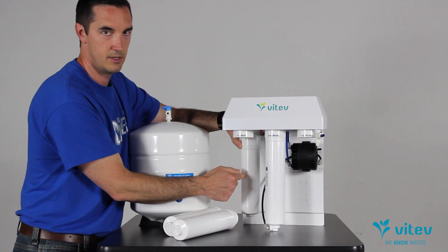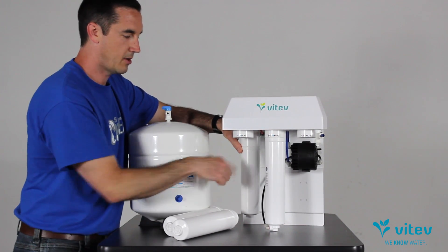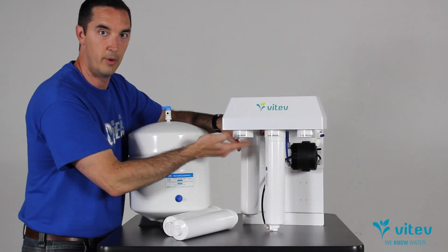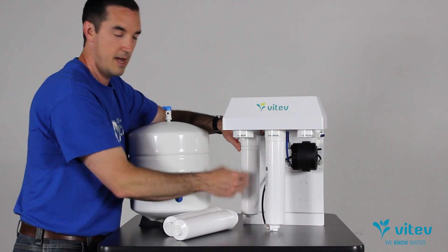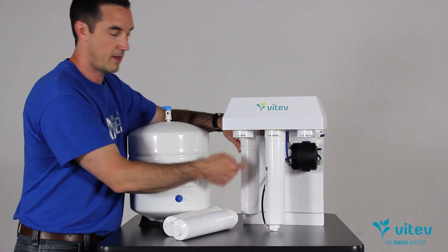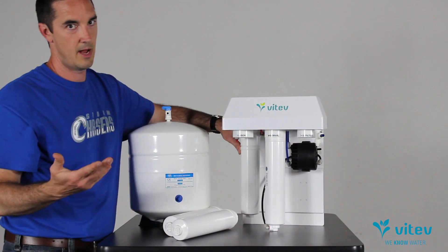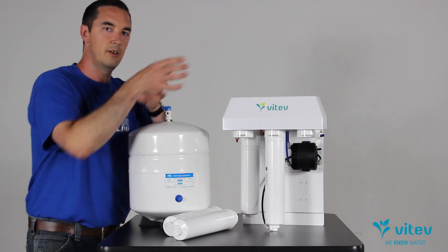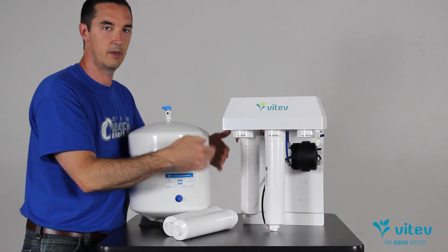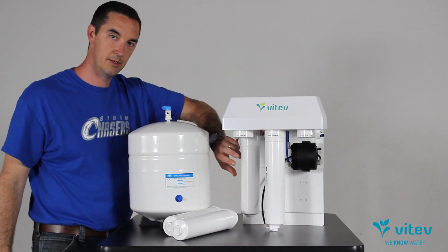Turn off your supply, take that cartridge off, and do one more step: put the carbon cartridge in its place. Turn your water back on and see if water flows through and comes out of the open hole just downstream. If that's the case, you have further evidence that the sediment cartridge is the problem. You can further solidify that by putting the sediment cartridge in the second slot — running water through carbon first and then sediment — and see if it clogs up again. You can interchange the cartridges in different slots to confirm: the one that works fine works okay, and the one that doesn't work still doesn't work even in a different slot.